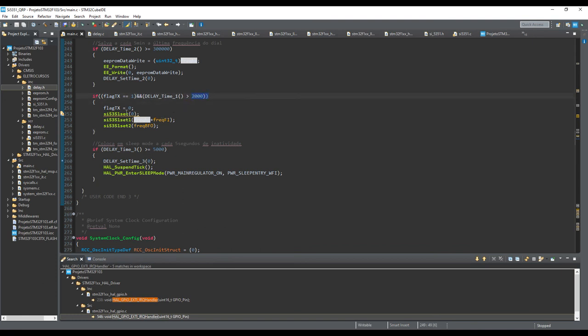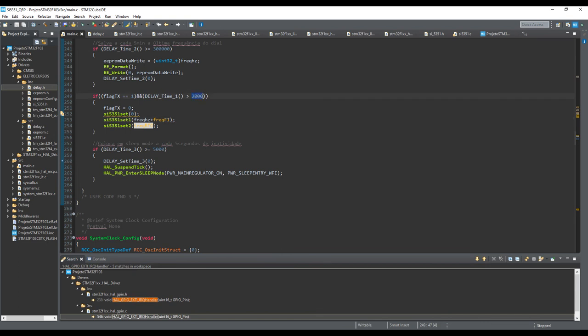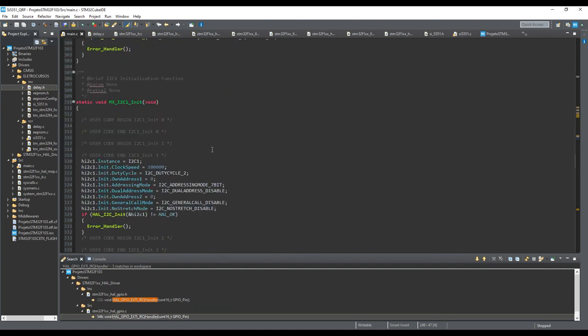And after these 2 seconds of the finishing of your transmission, you release the output from the main carrier, you set the reception frequencies for the BFO and the intermediate frequency, and you come again to the reception mode of your equipment. This can be changed, okay? This is a common parameter from professional radios. They have a possibility in a menu to change this inactivity time, the activity time for the transmission, okay? It's possible. So everything is fine when you know where to configure here, okay?